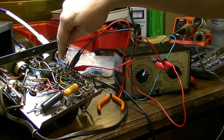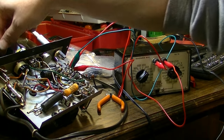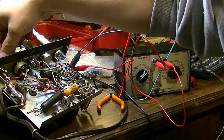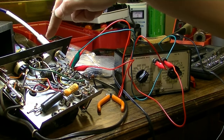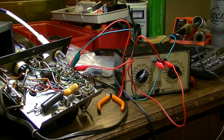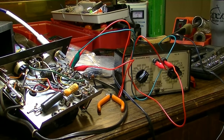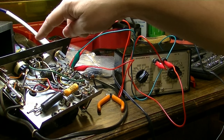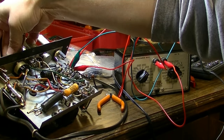I've noticed already that because of the grid-stopping resistor on the input, when I turn down my volume I no longer get that whoosh-whoosh sound, and I'm no longer getting blocking distortion through the amp. Now, the longer this warms up — I did notice I couldn't really turn my volume up past about halfway, and I'm suspecting that the cap going through the volume pot and back out to the output stage might be bad under heat. So we're going to test that theory by putting leads on the volume pot and testing for leaked DC voltage. That might be why it's crapping out after a while.